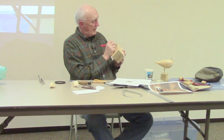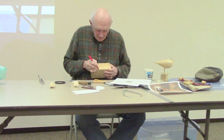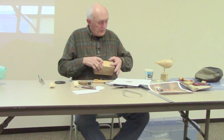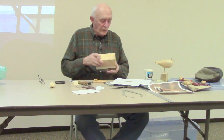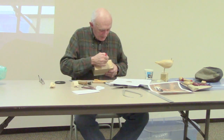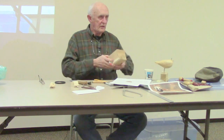And I will stop, back all the way out, go over to the other side, up to the widest part, cut all the way to there, leaving these 2 pieces attached. All right? Then I go around and run the bandsaw down here. I'll run it all the way to here and all the way to here. So when I end up, it's not real floppy, but it has some give to it.